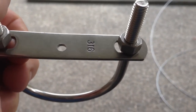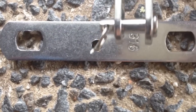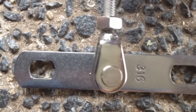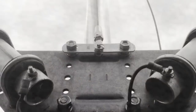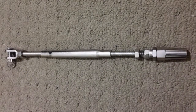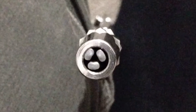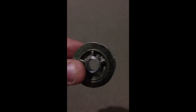I've got a 50 millimeter U bolt and drilled a hole in the bracket slightly off-center so that most of the meat would be holding the jaw clamp for the wire — that's the wire cable attached to the pulley. You can see the final assembly here attached to the original U bolt that clamps the antenna to your mast, and then you can see the pulley at the top where the cable feeds through and the pulley is centered on the pole. The cable hardware itself is pretty standard stock from Bunnings Warehouse in Australia. It has the jaw clamp to hold the wire, and here's the pulley — it's rated at a hundred and something kilos — and this is what it looks like outside of its housing.